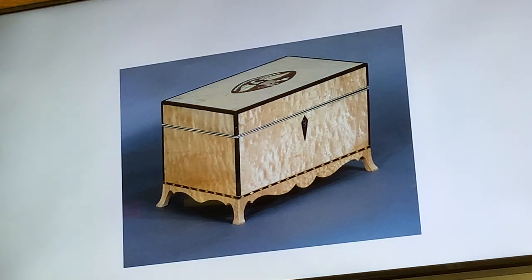You cut those mortises when you cut the feet out. You start out with a blank and you run the two mortises opposite, 90 degree corners, and then you bandsaw out the little feet, so when you get through, the little feet have a little mortise already cut out. And then the other side is just tenoning into it.